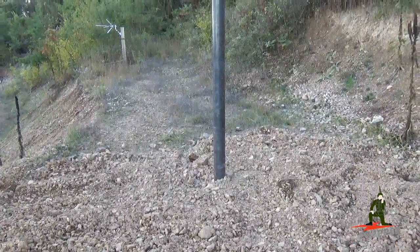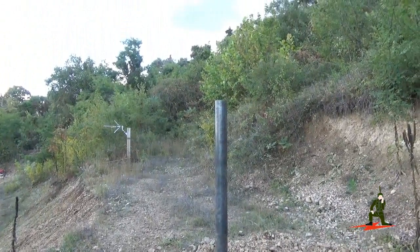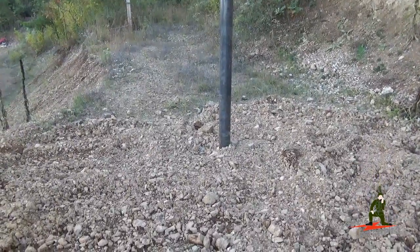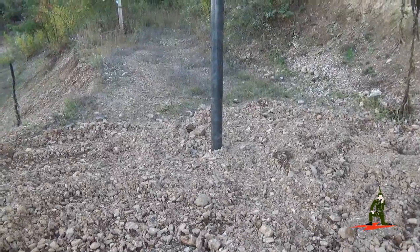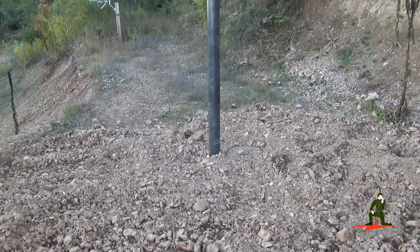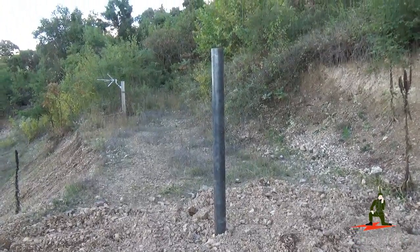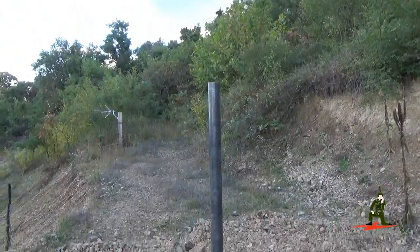That pipe is a steel pipe, 5-inch in diameter, schedule 40, 12 feet long — 6 feet above the ground, 6 feet in the ground. There are 15 60-pound bags of cement down in the bottom of that hole. We still have to frame out a base there and pour another pad just above that. I got shipping information from WholesaleSolar.com that the custom mounting brackets for the panel should arrive this Wednesday.